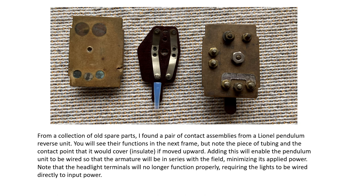Why do these motors sometimes get sick? I never fully figured that out. It could be that with heat over time, the insulation deteriorates and you get some shorted turns, which is exacerbated when you have more power on the armature. But for whatever reason, in many, many cases I've brought a sick motor back to life simply by changing the wiring method.